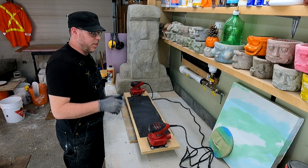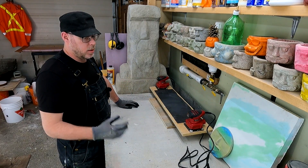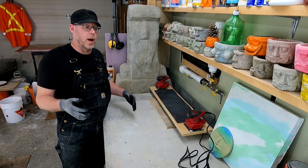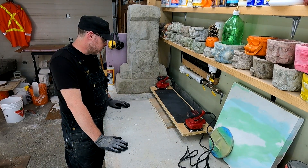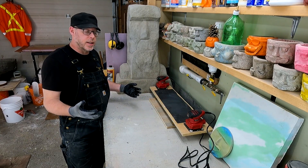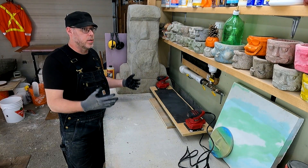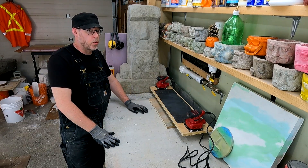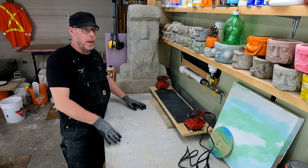It's still loud as heck but it definitely works really well for vibrating concrete. Just check these a little bit later and make sure they stay tight — that should be regular maintenance. I got bolts that are a little bit longer so it's not just going to let go suddenly; you'll notice the washers start to get loose and then you can tighten up again. Lock washers work really well but they're not a silver bullet against worst-case vibration scenarios. I think it's pretty effective and versatile — a benchtop unit you can use for small, medium, or large pieces. The single quarter-sheet palm sander has plenty of power. If you do a lot of this, invest in the variable-speed palm sander for more controlled vibration.